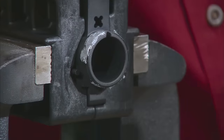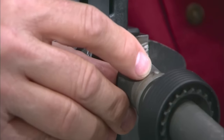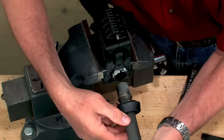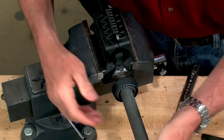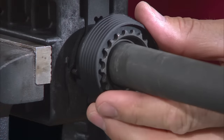The top of the barrel sleeve has an indexing stud which mates with a groove in the receiver, assuring the gas port is indexed to top dead center. Slide the barrel into the receiver and screw on the barrel nut just until it's hand tight.